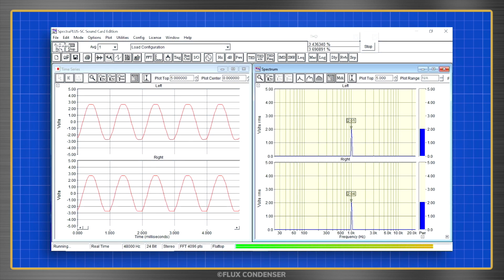Now, we're only interested in the power that the amp can produce without distortion, so I'll now reduce the amp's volume until there's a smooth-looking sine wave and distortion is below the rated 0.5%. At this volume, the software tells us that the output voltage is about 1.8 volts AC. The real voltage is actually 10 times that, though, and here's why.